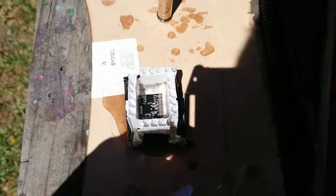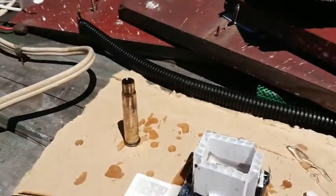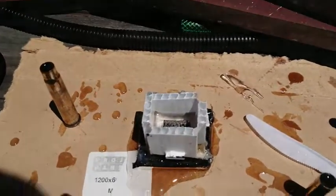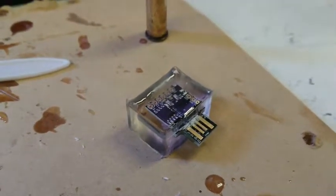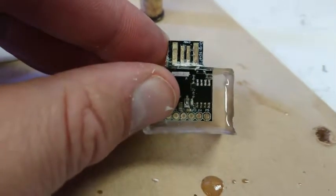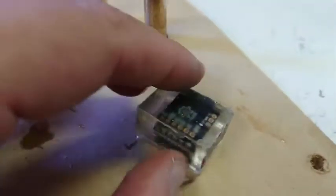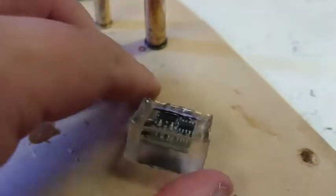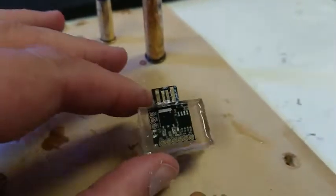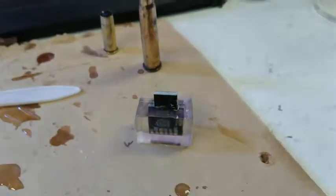After a bit of time in the sun, you can see there's quite a bit of nice clear resin in there and it's set nice and solid. I also took the time to fill up some shells I'm planning on casting into resin — this particular one was dug up out of a World War 2 target training range for Bofors gun turrets. Out of the mold now: a little bit of resin seeped out along the contacts, but after scraping it looks like I might get away with having clear contacts. The back seems relatively okay — it's in a block with enough room to work with. It's nice embedded in resin; nobody's going to tamper with that, and I can see the light flashing through it.